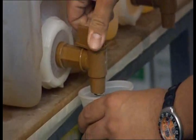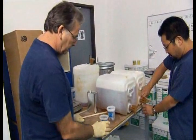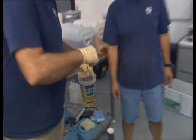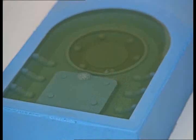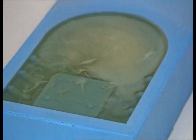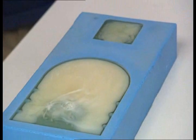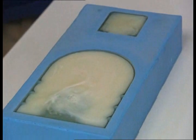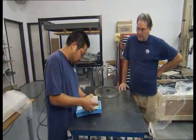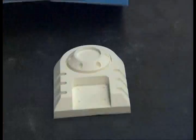A two-part urethane will mix together for the final component — a quick-to-harden mixture that has a brief five-minute pot life. But if all is done correctly and the right mix makes it into the mold on time, after a 10-minute curing, a part is created. Instant part. I hope all goes well.